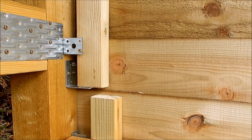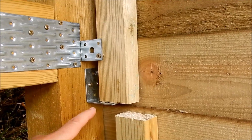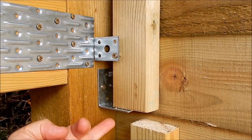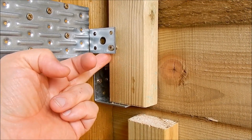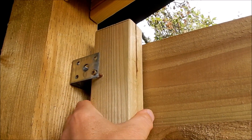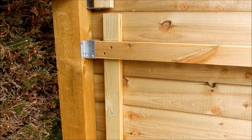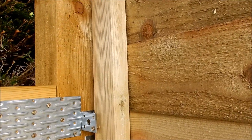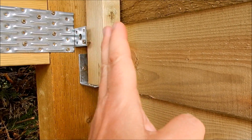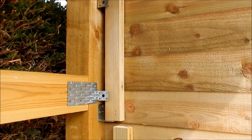Now the above panel — and these are two separate panels — there's a sort of 1.2m square panel below, and about 600 or 500mm above. Now this is much simpler. You've got the upright, the 38s, and this is completely rigid and pulled hard into the shed. So it's held up by a lifter bracket, and it's pulled inwards by a puller bracket, and there is a second puller bracket up there with just a single screw pulling this beam into the shed. You can see there's a lot less gubbins on this top arrangement than on the bottom. And of course if I want to insulate this shed, which will be done between the outer panelling and this inner position, so you'll have approximately four inches of insulation depth, you want far less stuff on the inside of the panelling, and my second idea has far less stuff.